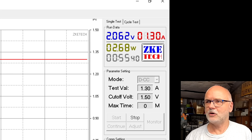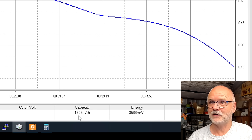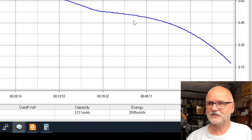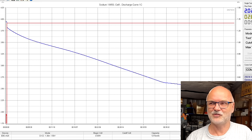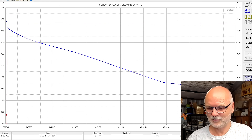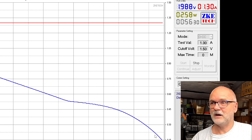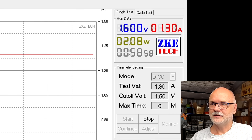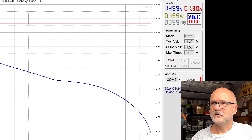We have reached close to 2 volts after 55 minutes, having discharged 1.2 ampere-hours out of this battery, still discharging at 1.3 amps. We've left the little plateau and are now going steep into the knee. These cells don't really have a plateau at top or bottom — the charge curve is fairly linear all the way through. At 2 volts we are around 95% discharged. Now under 2 volts, at 1.65V, going really steeply down.